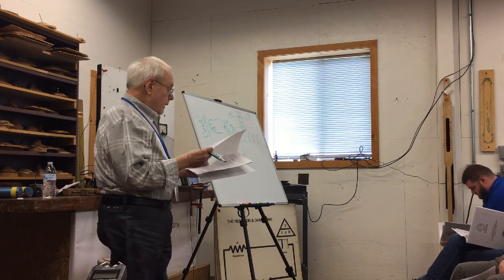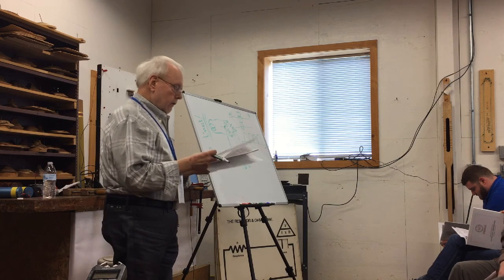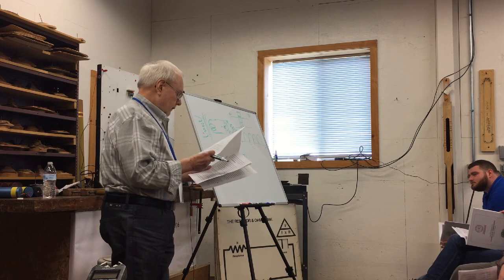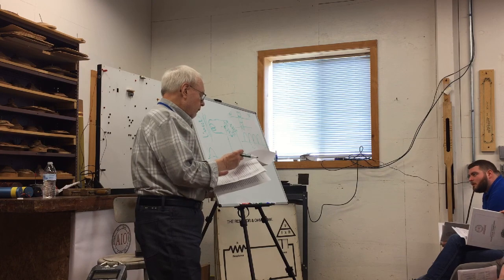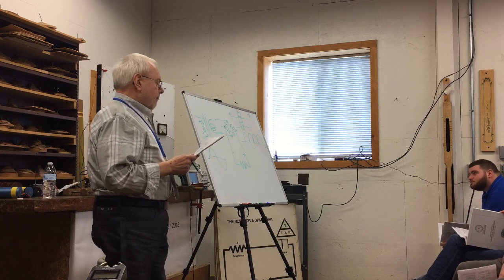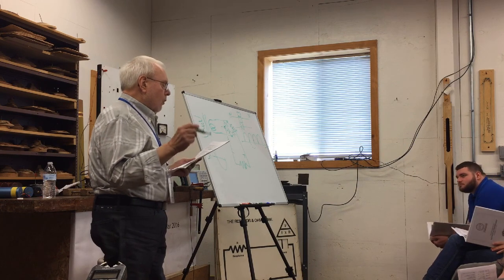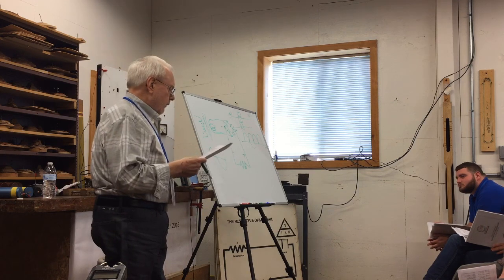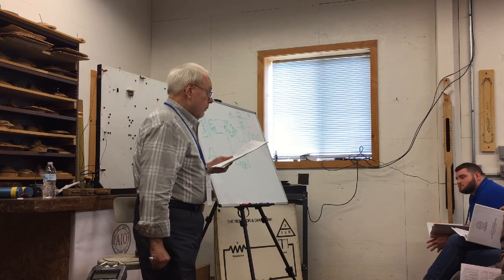Just to confuse you, the N-type silicon has an abundance of electrons, the P a deficiency. Physicists will tell you that the P-type silicon has abundance of holes, or places for the electrons to nest. We know that electrons are flowing from the N to the P, but then we're told that the holes move from the P to the N, which has never made any sense to me. Fortunately, we don't have to be physicists to use a diode, or even to buy one.